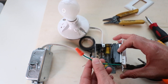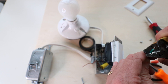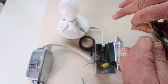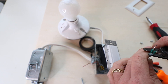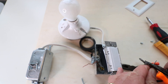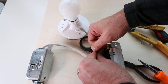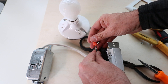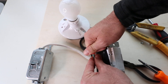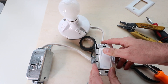The last wire is the ground wire, so we're going to wire that up to the ground wire in the existing junction box. Some of you will have a shielded ground wire, some unshielded, and some won't have one at all. If you don't, you can still install this switch but won't have ground protection. If you have a metal junction box and conduit, it's grounded through the conduit. With a plastic box and no ground wire, it is not grounded. Go ahead and attach the ground wire — now the switch is ready to go back in.